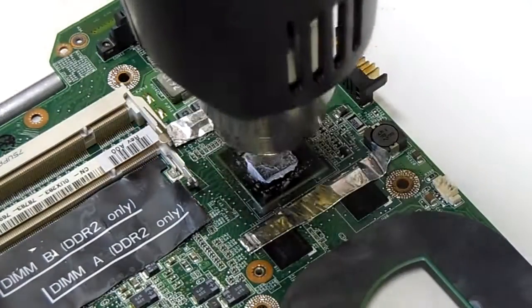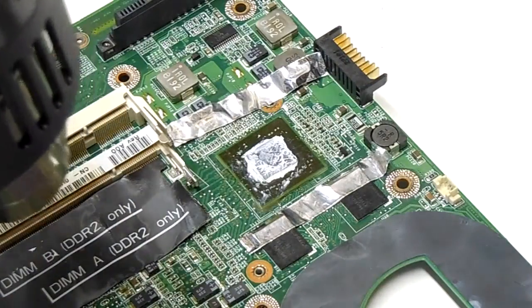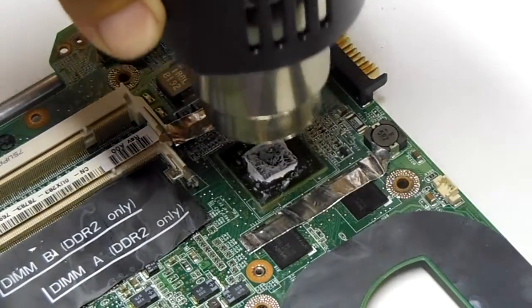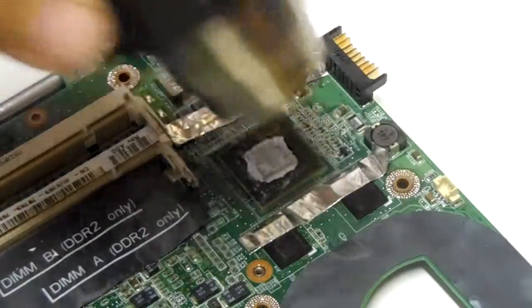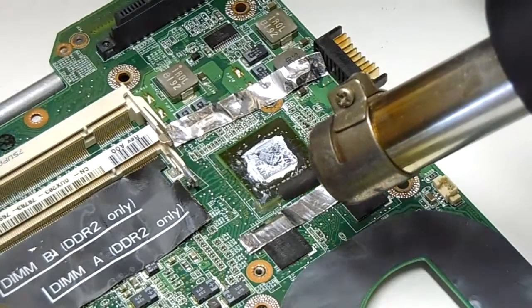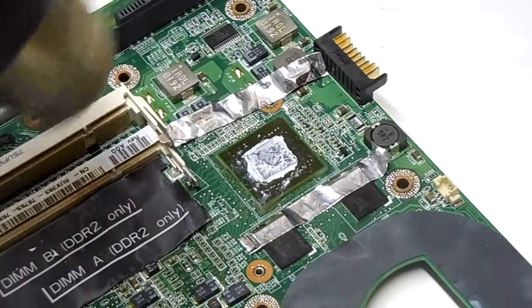So we'll point this at it and go in a circular motion, because you want to get all the solder hot at once. I like to go for about 30 seconds, holding it about half an inch from the base. You could try a lower heat setting and heat the board up first. The other tool we use sometimes is a hot air pencil, which gives a little more precision, but the problem is you can't keep the whole chip hot at the same time.